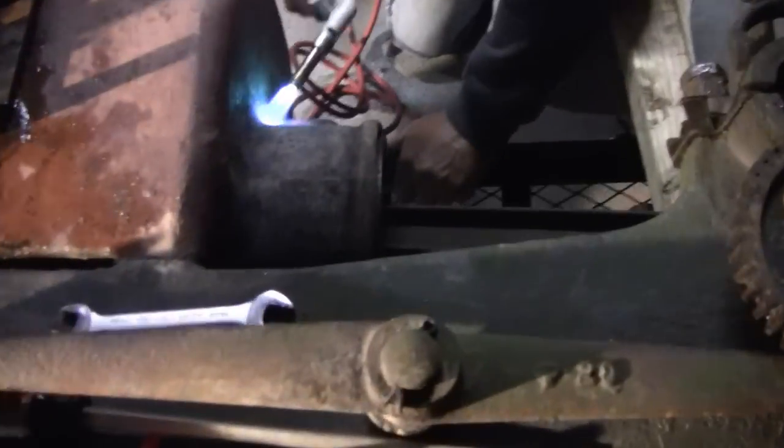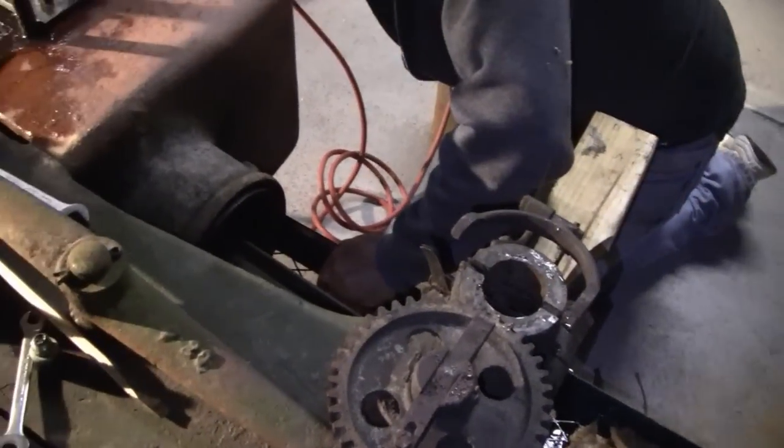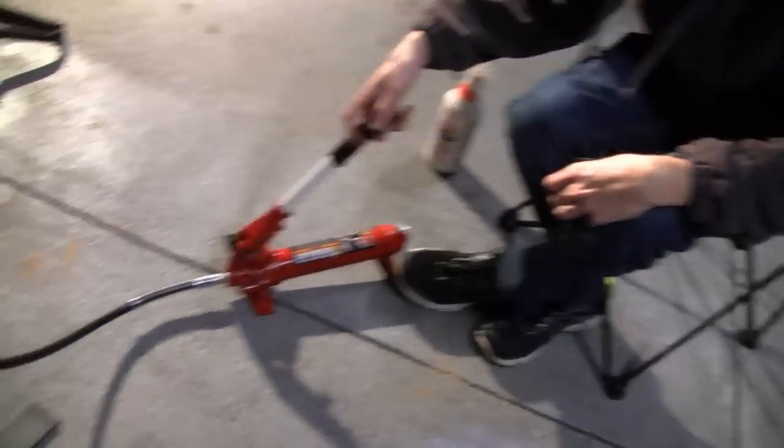John, he's heating up the cylinder. I don't know if you can see it, but see the cylinder sticking out a little bit. It was recessed a little. And I'm hitting on the end here with a piece of oak and a sledgehammer. And we're getting some movement. So once we get a half an inch, maybe a little more movement, we're going to put the flywheels back on and shimmy it back and forth. Go ahead, pump it up, buddy. All right, buddy. I hear it moving. I don't know if you guys can hear it, we got rain hitting the top of the ceiling.